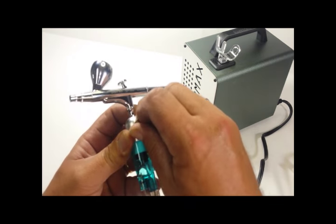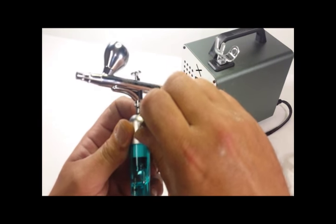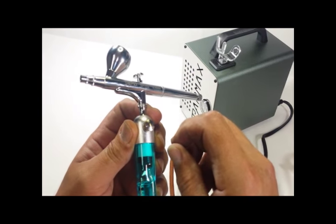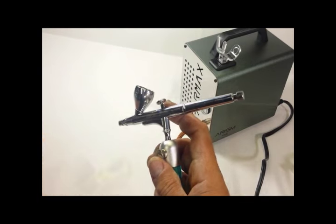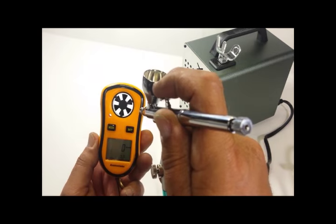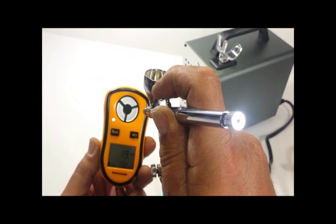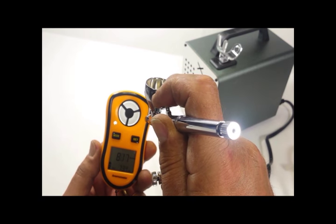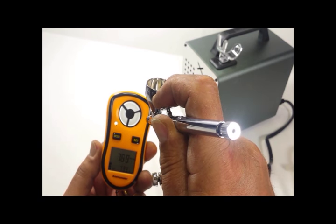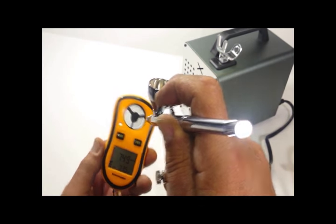I also placed the compressor in a location next to me on the floor, typical of where I would normally use it, which is about 2.5 feet away from my working space. The decibel meter then recorded exactly 45 plus or minus decibel levels, as outlined by the product documentation. This equates to the compressor running very quietly, something similar to a normal voice level of a person talking.